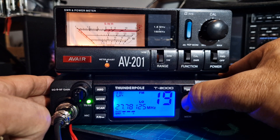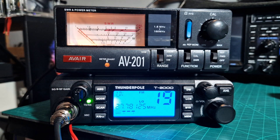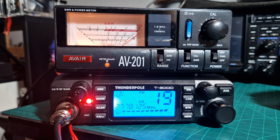Quite like the blue, it looks all right in this light. Let's have another go at doing this SWR calibration — we've got it on forward, 5 watts, and then we're going to key the mic.